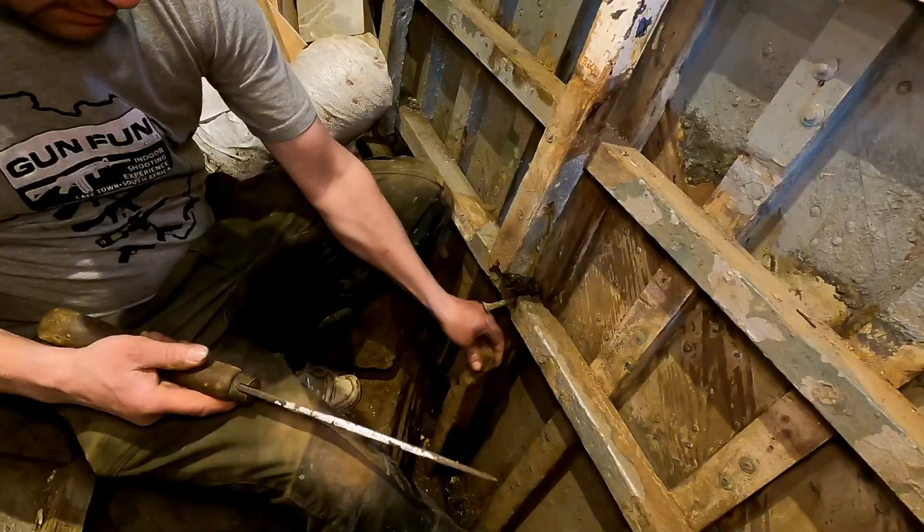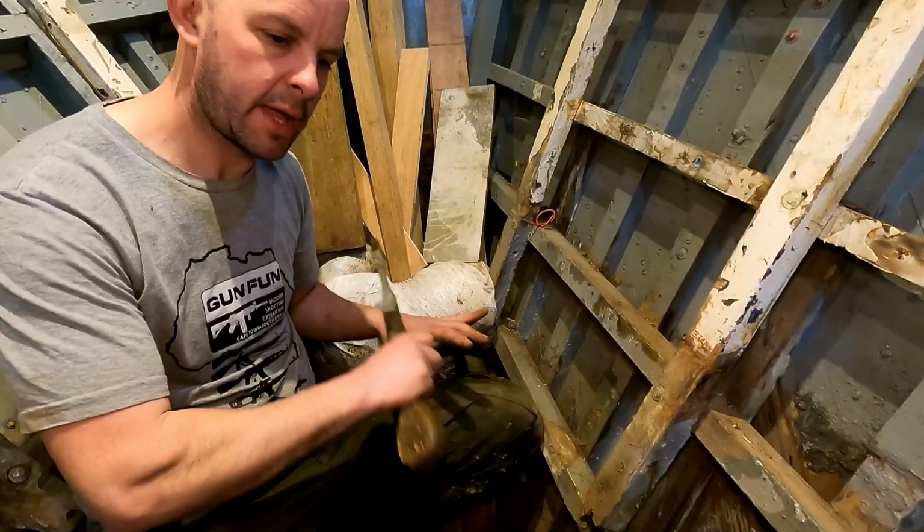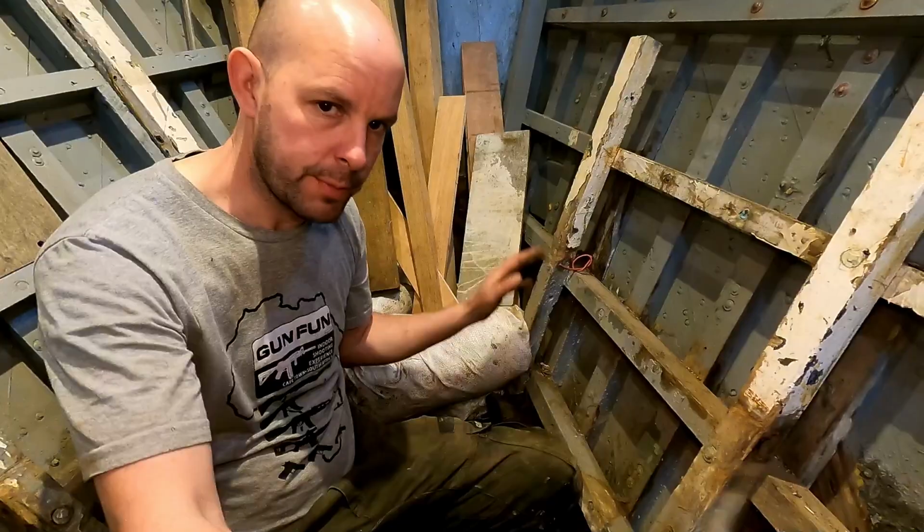So here's our web. So I'm going to cut the bolt in a minute for that. Got to reveal some space here to get into here. We've got to cut a section out and see how far back the rot goes. And then we'll try and get a new sister on the stringer as long as we possibly can in this location. May as well go along, haven't we?